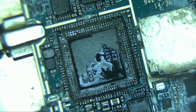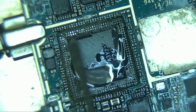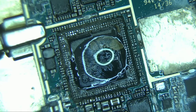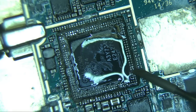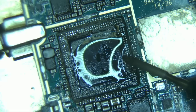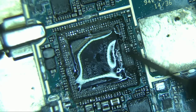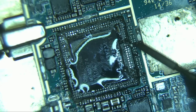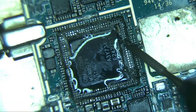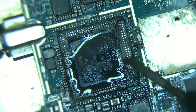But not too hot where the bottom chip moves, or the underfill glue beneath the lower chip expands and causes it to break a joint. Now that we've removed the top processor chip, we're going to proceed with cleaning the top of the lower processor and getting it ready to install a new chip.